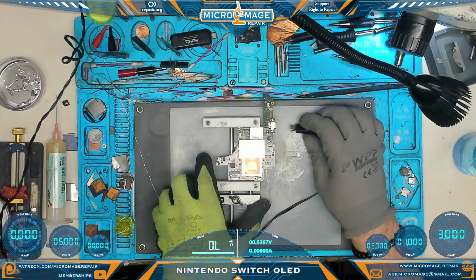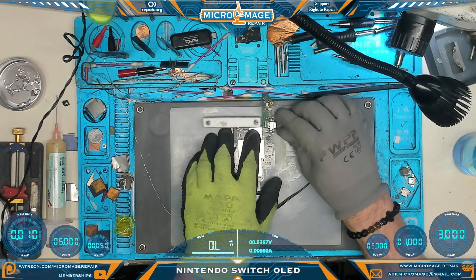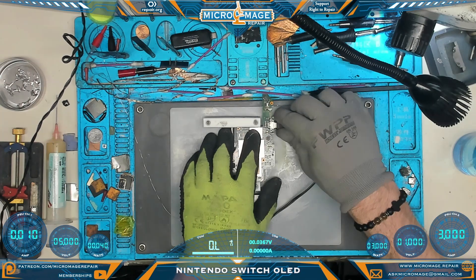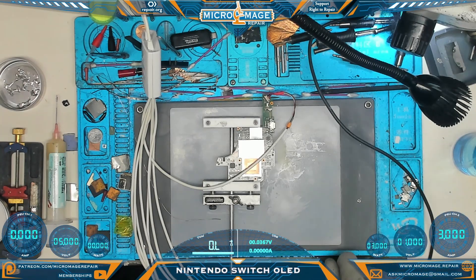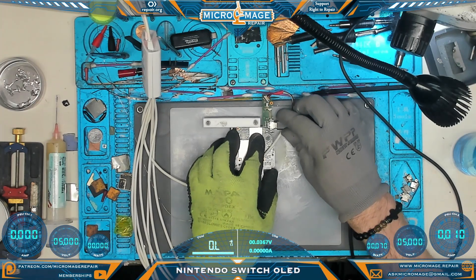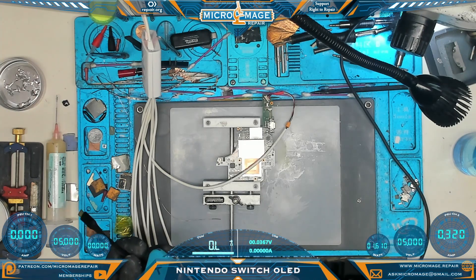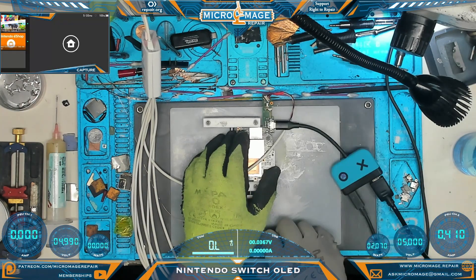This is the whole setup we use on the bench top PSU for testing. On this test I just want to see some recognition on both sides of the port - it's not always reliable so don't make any definitive conclusions based on this test. Okay, not exactly what I want to see - try the other side. Okay, not so much. Now we're going to use our modified iPhone battery squid - it is the same connector as the Nintendo Switch original, and what we want to see here is just a steady climb in amperage with no hanging. Activate with the OEM - it looks to be booting fine. Let's try and see if we are docking - sometimes you have to try it on both sides - and there we go, we're docking.